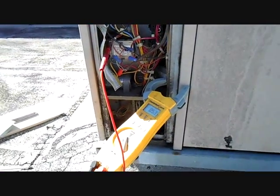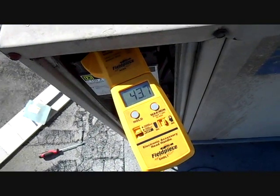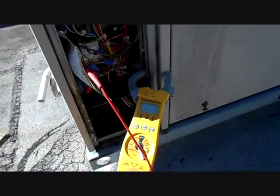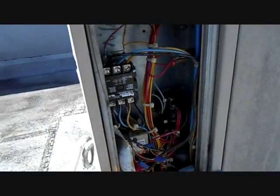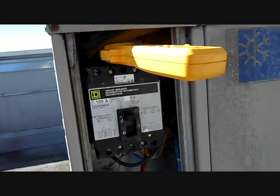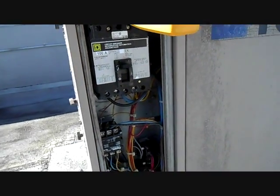But I'm going to go downstairs and see if our thermostat display is back and I can turn this thing on in electric heat. All right, I have my 43 amps of heat strips running now. Blower running. Nothing there. As you see, the unit shaking, being on, so that one is on and good to go. So the McDonald's people will be nice and warm now.